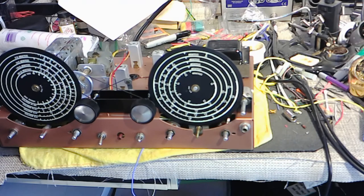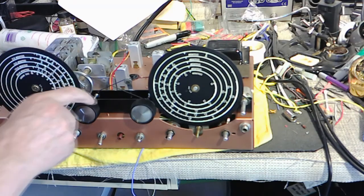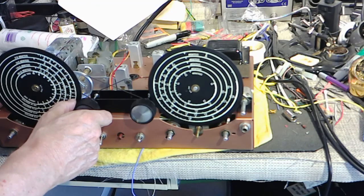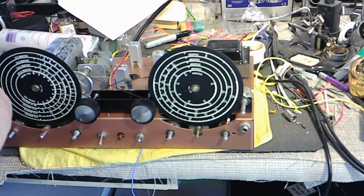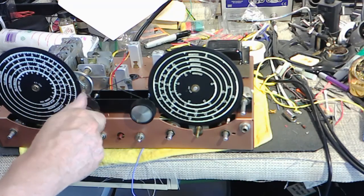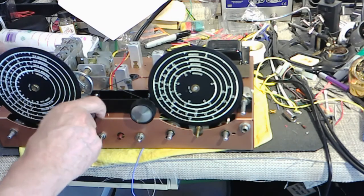Have you ever aligned a radio by cheating? You know how you cheat? Move the band indicator a little bit. I just can't get it down to that frequency because it's so old. Well, I can. And then everything else lines up with that. It works. It's not actually cheating. You can do it that way. It just means that you better have all the bands work.